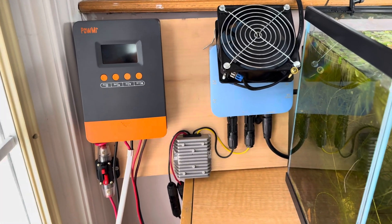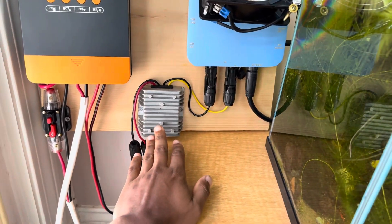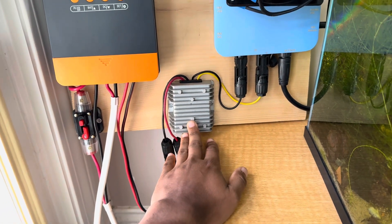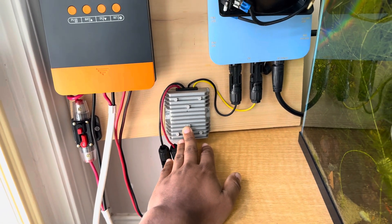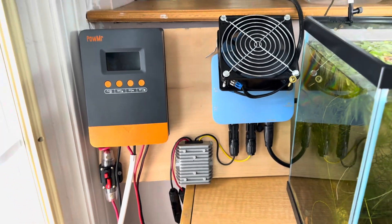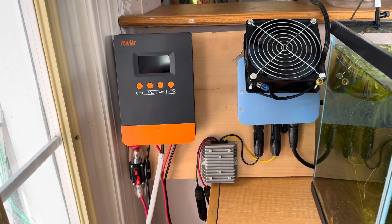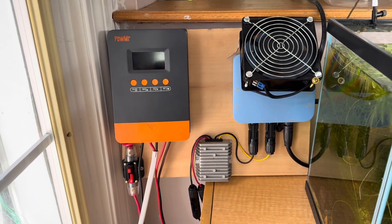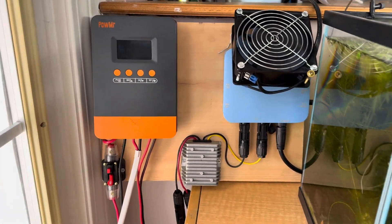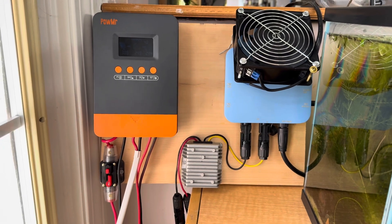Before I was running this at maximum 500 watts, but right now it's limited by this step-up boost converter, which is only 250 watts. Before, it was running at the full power of the solar panel, and this panel produces around 700 watts depending on the tilt and the day, but mostly 600-something watts.